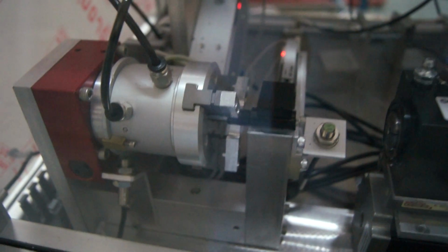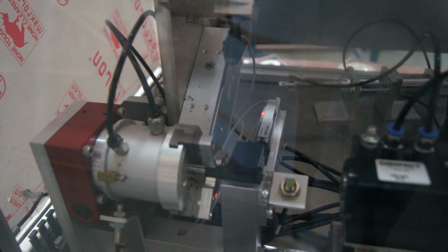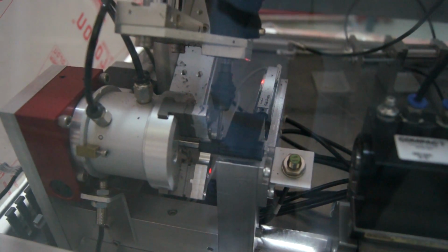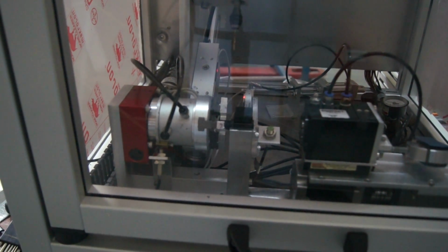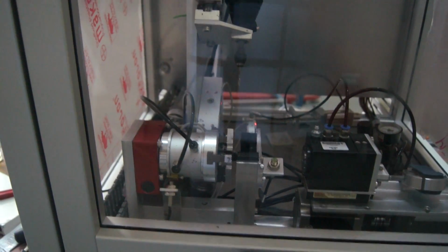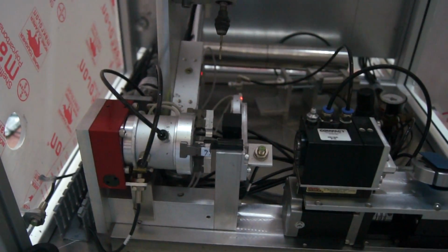Okay, so now the rotation is going to occur back to the point where the load was triggered. And then the drill comes forward. Okay, rotation goes back home, opens the jaws, moves to the load unload position, and now the system says ready for product removal. So at this point, you can open the door and remove the rotator body and start the next cycle.